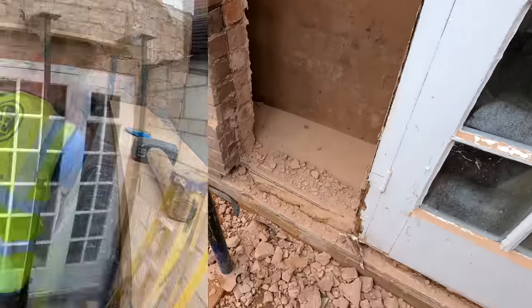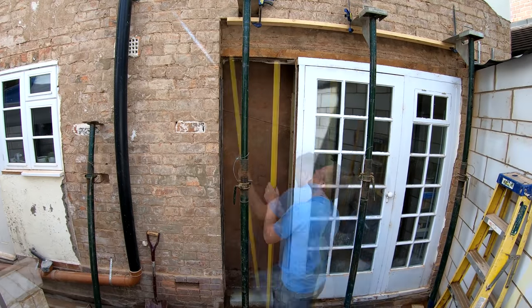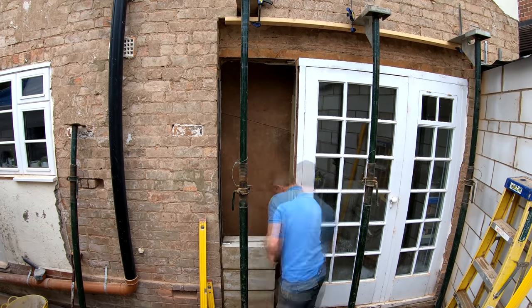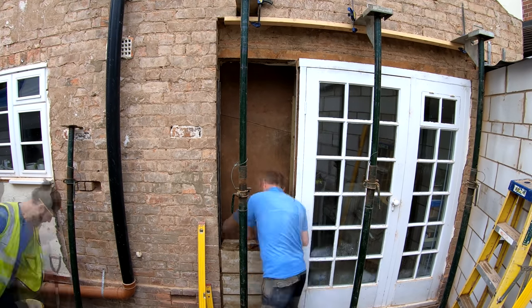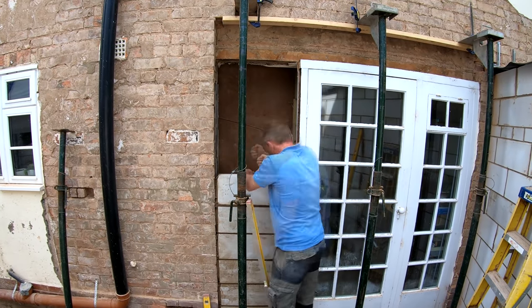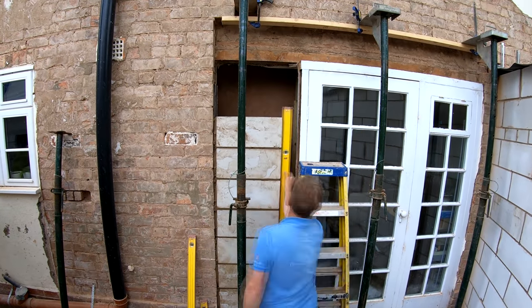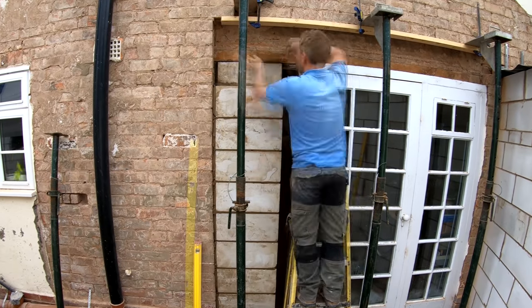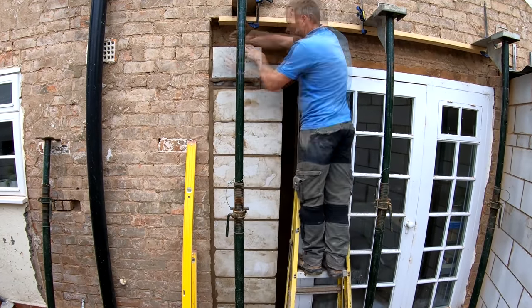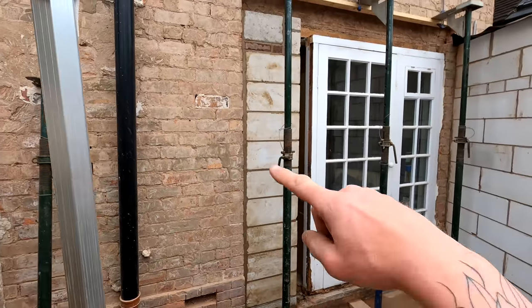What we're going to do now is get this area sorted ready for the block work to go on, get our wall starter kits on up here, and then by that time Alex will be ready to drop straight onto this and start blocking it up. We're going to use some bricks on the bottom with a damp course and damp proof membrane just beneath it, and then we're going to use seven newton blocks flat all the way up to the height we need for the padstone, and then a little bit more for this lintel across here as well.